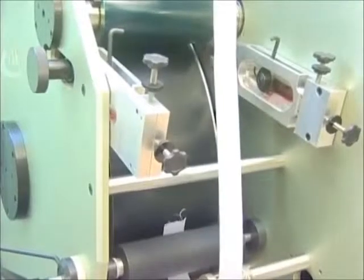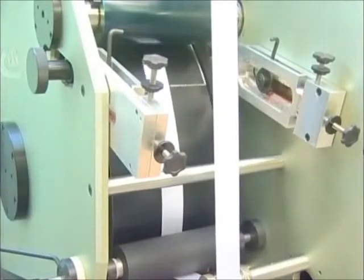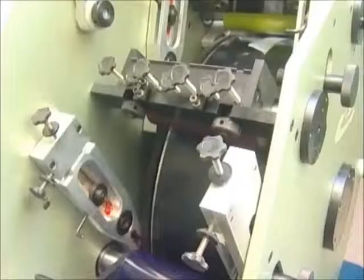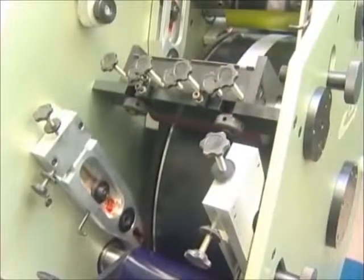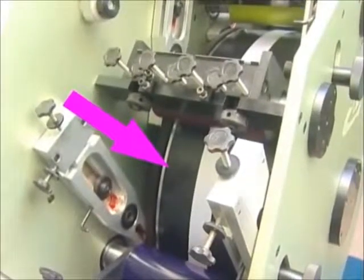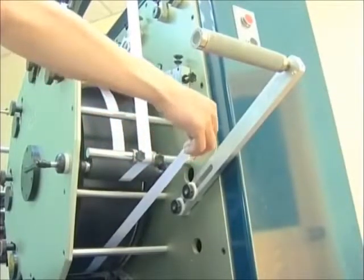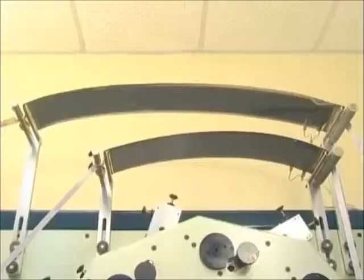There is a ribbon conveying roller in the middle of the printing station, which is used for conveying ribbon. A double-sided adhesive is mounted on the central drum. The adhesive fixes the ribbon on the central drum to ensure the ribbon is not displaced. The 2 plates on the top are heating plates used for joining the ribbon after printing.